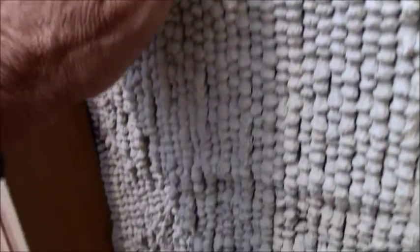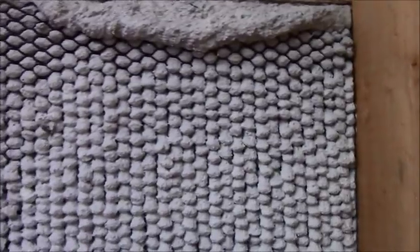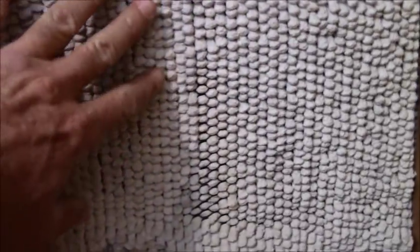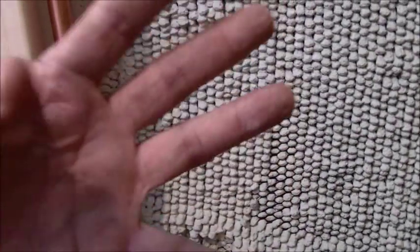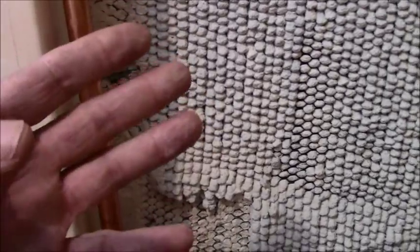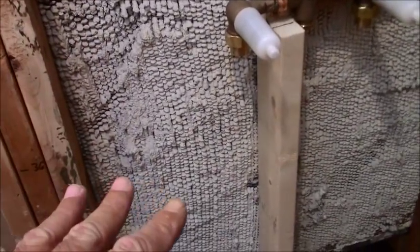These walls weighed a ton because of the way they used to do things back in the day. I give a lot of props to people from the turn of the century through the 70s who dealt with wire mesh construction and floated out their walls. The floor was the same makeup too — so yeah, an easy 1,200, maybe 1,500 pounds of material. If you're going to do your own bathroom renovation and tear this out, understand there's wire mesh and all that stuff. You can't just demo the tile — you have to take out the whole wall, and you'll need crowbars and manual tools to pull all that wire mesh off the wood.